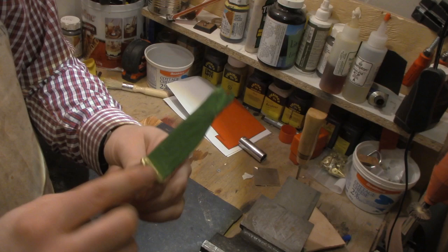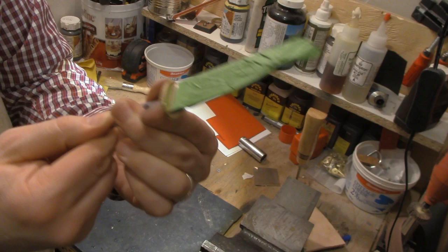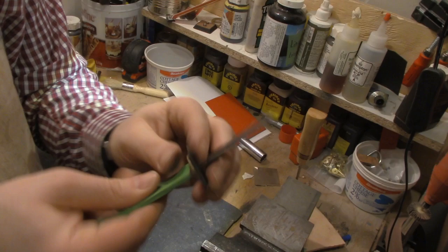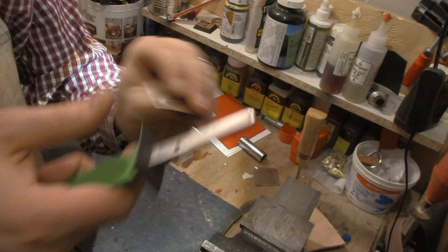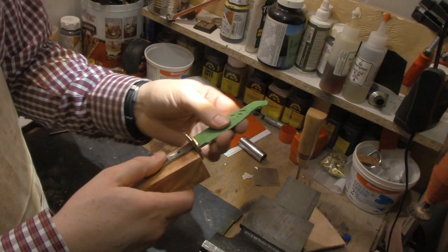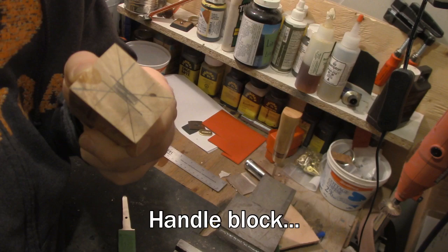The filing is done on the first top piece of the bolster and it's a pretty good fit — pretty happy with it, though it could have been a little better. There's still definitely a learning curve to get that bolster right. I also went ahead and added a little piece of vulcanized fiber, and then another thin piece of brass — got the hole drilled and filed there. So those three pieces will go together, and the next step is to drill the hole in the block for the tang to fit in, then we'll glue it all up.